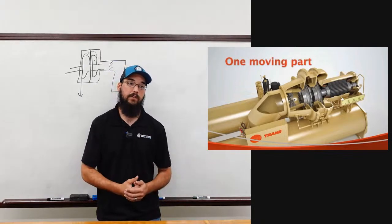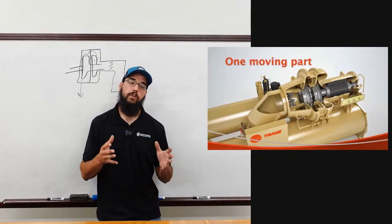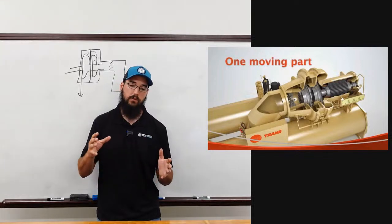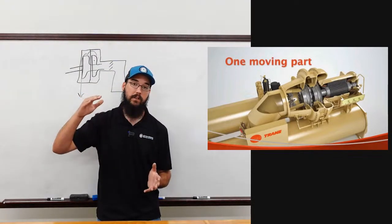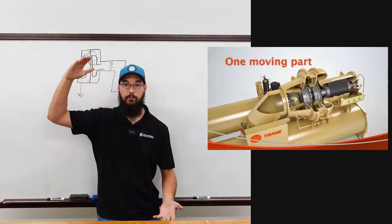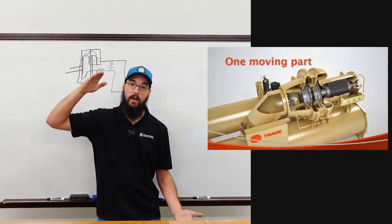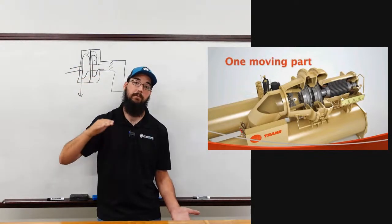for example, I've got some buildings that try to run a 42 degree leaving chill water. When you do something like that, it's very critical that your condenser water is under control as well, and your building is capable of handling that. Because what happens a lot of the time is on the really warm, hot and especially humid days, when your wet bulb is high, that leads to higher condenser water temperatures. And those higher temperatures are going to raise your head pressure, because those are relative to each other. Water temp goes up, head pressure rises, PT chart. That leads to a high lift situation, because they can't control the condenser water enough to keep the lift down.